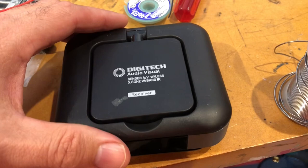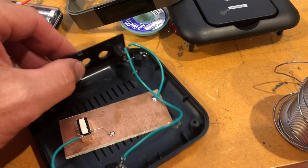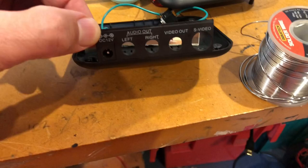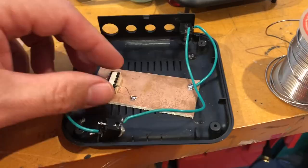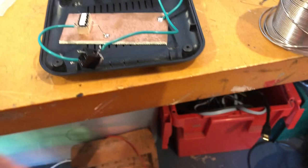So what I've done is I have ripped the electronics out of this case, and I'm going to do an ugly build on this key for the Hermes Lite 2. And we're building ugly style. And that's the start of the build. I've taken the DC barrel that was on the circuit board, and it was a circuit board mount one. I could have got one that screws in, but what I've done is I've just got super glue and glued that in. And we put the relay on here, dead bug style, and we'll go from here. So once I've got all the bits and pieces in, I'll show you the completed build, and we'll put it in the server and see how it works.